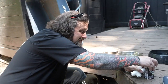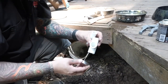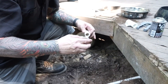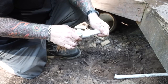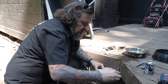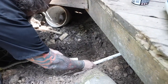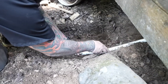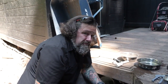All right, now we're down in the trenches. I've got a three-quarter-inch sprinkler so I've got three-quarter-inch threads coming out of this T. I'm going to pre-assemble and glue this up so I can get it in the hole and have it standing straight up. A little more glue on this side — that way I've got it right where I want it, and we'll continue on with the rest of the pipe and then hook the sprinkler.